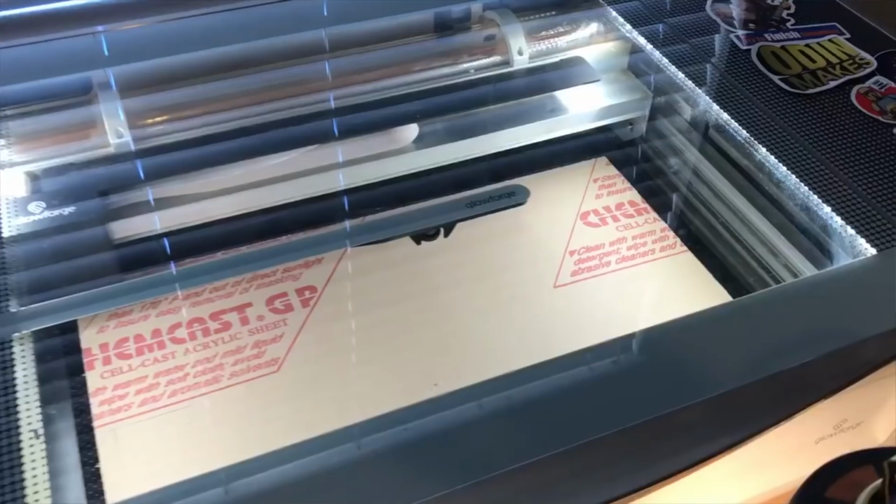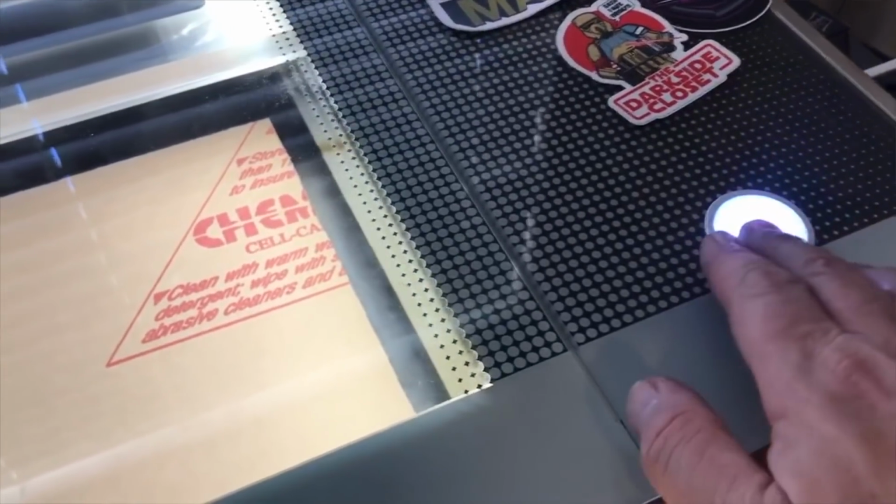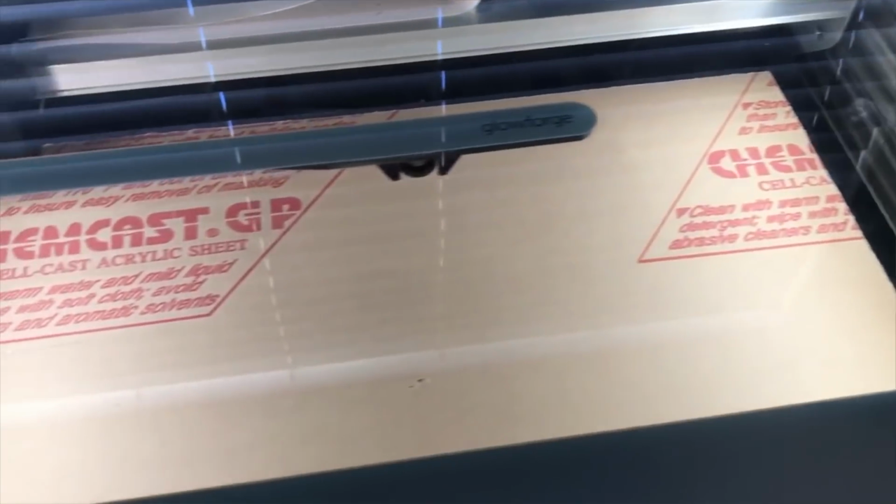So with the artwork, we had side one, which you would lay in the machine and etch out all the designs that go on the first side. Then you would want to flip the plastic over, hopefully with the same registration. I'm assuming it would work like a scanner where you've got a corner and you stick it in the corner and you know where it's going to be. Apparently it doesn't work that way. So you'd flip the plastic over and etch it again on the other side that's clean, and then come back and just cut it out.